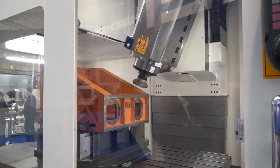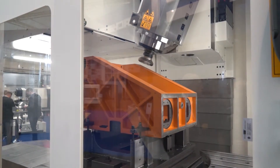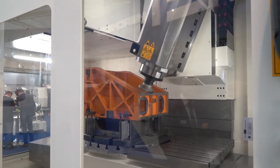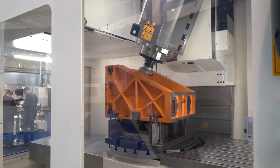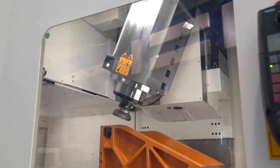What's different with this Spinner machine? Well, for me it looks a bit bigger than most. What is the size of it? It has a 1.6-meter X-travel, and the Y and Z-axis are also very big, so you can have a large envelope of workpieces. The round table on this machine is 900 millimeters, and we can cover workpiece envelopes of 600 by 600 by 600 millimeters easily.